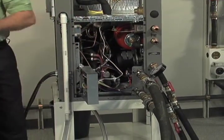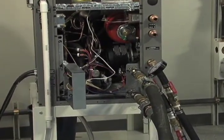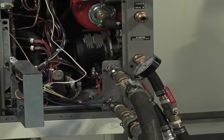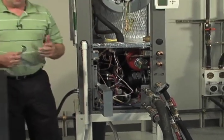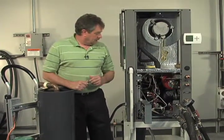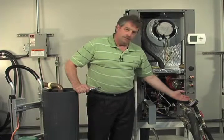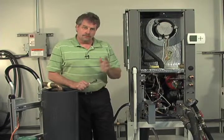We're going to go ahead and shut the pump off and watch our pressure gauge to see if there's any tail off. This would typically also be the time you would burp the pump. Typically with a Grundfos pump, you have to burp the ceramic shaft, but these internal variable speed pumps do not require any shaft burping, so there's nothing to do back there on the pump. So at this point in time, as long as there's no tail off on your pressure gauge, which has been mounted in here between the heat pump and the loop, you're completely purged and you're ready to go into service and do a proper startup.